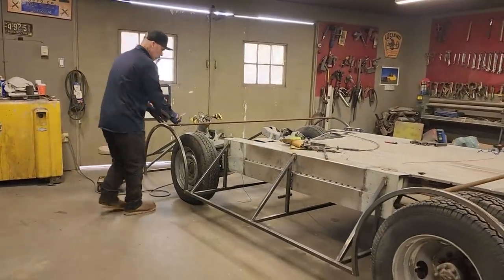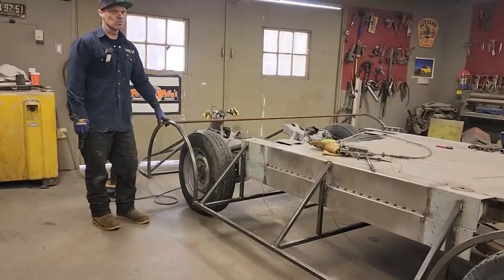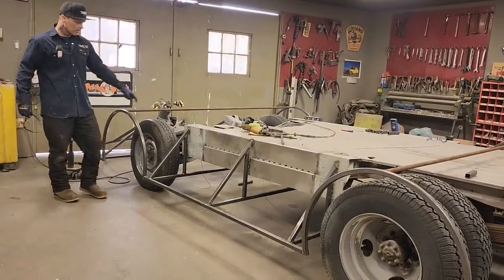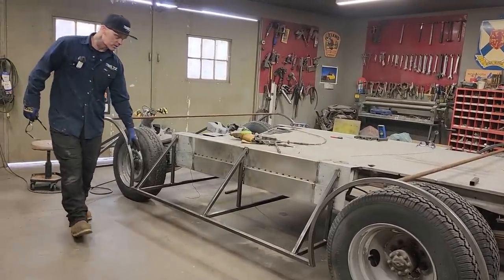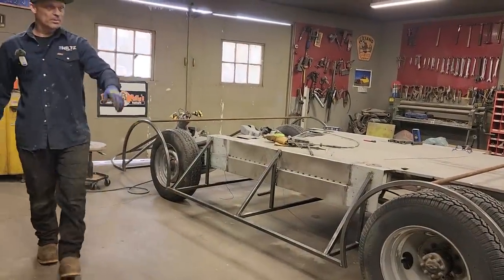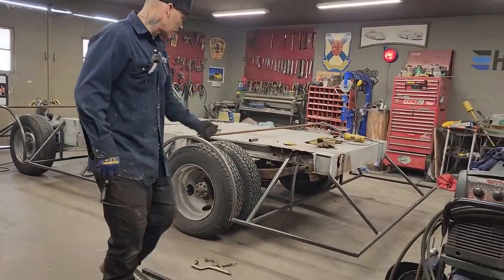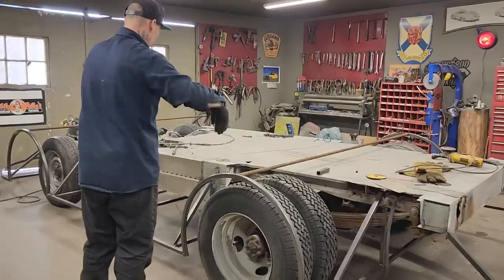I've got the ladders pulled out because I have all the braces put in it. Not everything is exactly where it needs to be. There are some things that might get cut out or might not. But I took the round stock that we had holding the wheel arches separated out, because we have the new square stock down there. We have it braced up the front, in the middle, in the back, on the side, behind the wheel. You can see how I did this one. I put it over top of the leaf spring, and then I put it up to the chassis. So that's braced in there nice and tight. I have these in for the wheel gap, so we're exactly the same coming straight up and down.